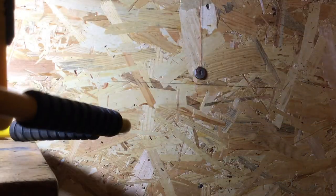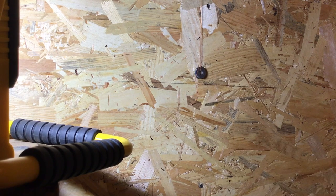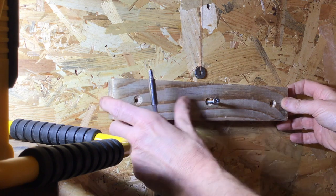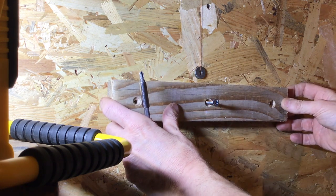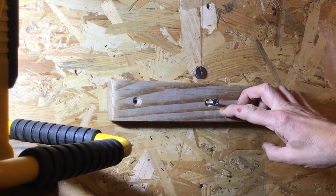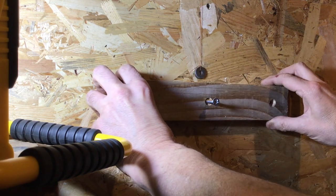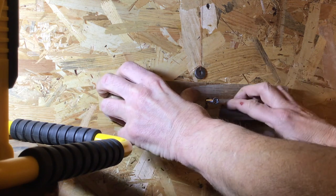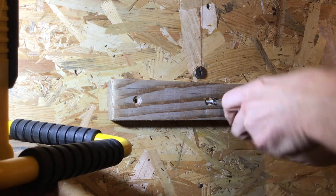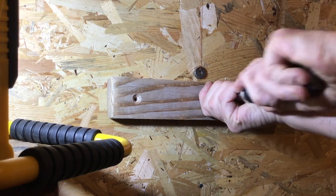One moment. So, take this and one screw and a screwdriver, put it on the line in the middle. Oddly enough, my hole is exactly the same fraction out from the middle, so that should be there. And get it on the line. Now you can't see it, but what you now do is, using your fingers, inch it up about a millimetre and a half. Just a millimetre and a half. And then, this is doing it left-handed, make a mark in the wall that you're going to find. I'm just going to screw this in a couple of turns.